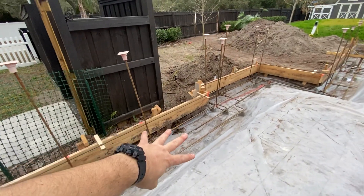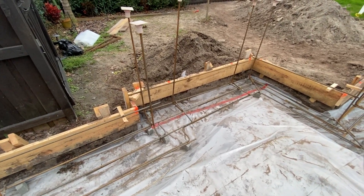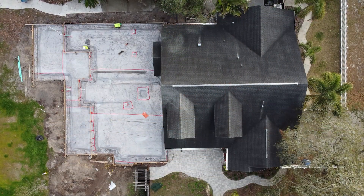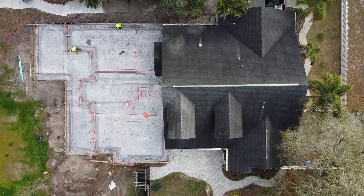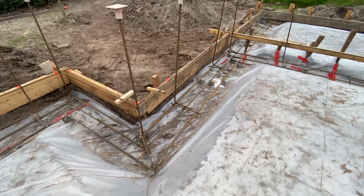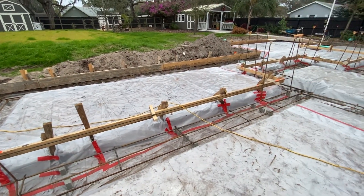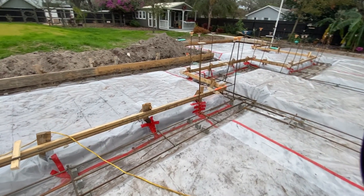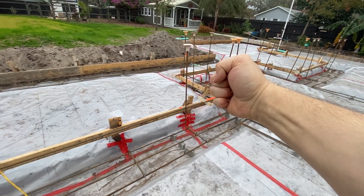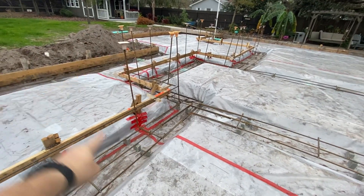Everything looks good. There are three bars everywhere all along the perimeter of the foundation — really wide footings, 28 inches wide by 26 and a half inches deep. The engineer only called for 24 inches, so we're overbuilt, which is a good thing in Florida. Coming back here, you'll notice these uprights everywhere — this is where a filled cell will be with concrete. Once they lay the concrete block up, they'll pour those cells all the way down, tying into that piece of steel with a strap to create a continuous tie beam all the way around to the roof system.